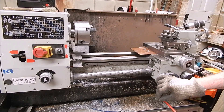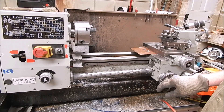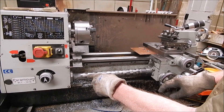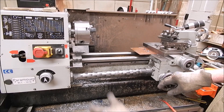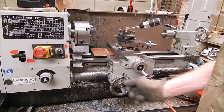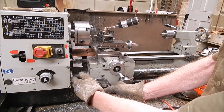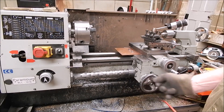Anyway, I'm getting away from what I was talking about — the lead screw covers. This morning I had the misfortune or carelessness, I broke a shear pin. There are two shear pins up this end, the drive end — one's original and one is bronze, I just used a bit of bronze brazing rod, works fine. Over the years I've done countless numbers of them. The problem with these lathes is they come up to full compression right where you're up close to the lathe, so you've got to be damn careful you don't lock up and crash the covers. It's easy to do, believe me.